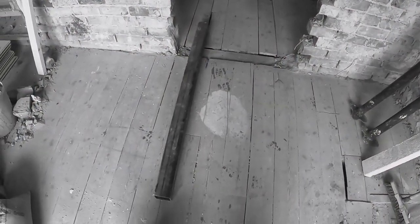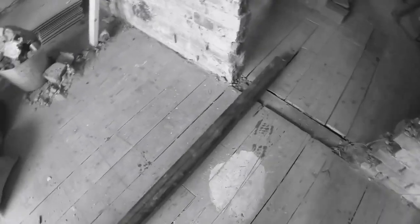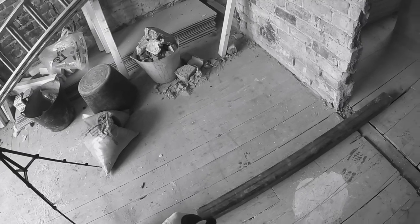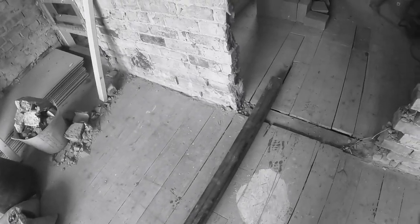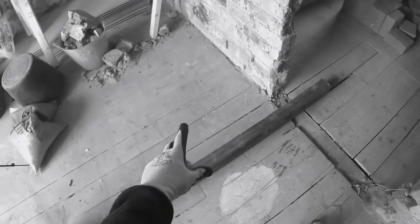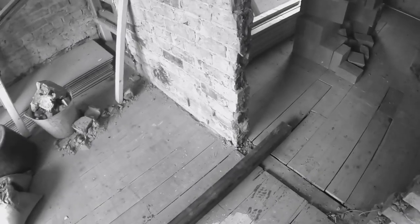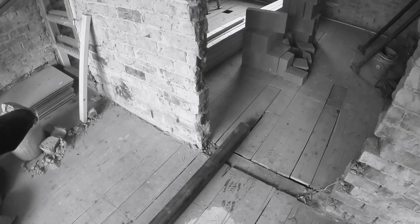So I just want to show you what I'm going to put in, which is this. You want to try and work it so you're going to land on one of the joists. The joists are going in that way, so there's one here — you can see just there — and then over here there's one there. We want to aim for them to prop this up. We'll put some bits of wood underneath to try and spread the load a little bit. I'm going to have it just so because I'm working on this side here, giving a bit more room with the length of that.